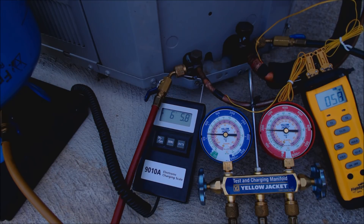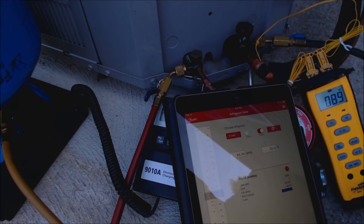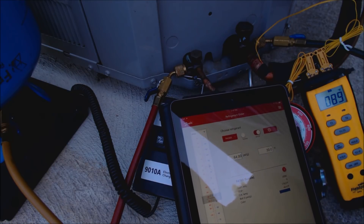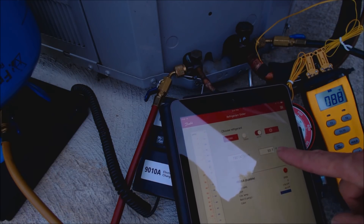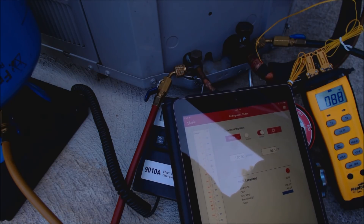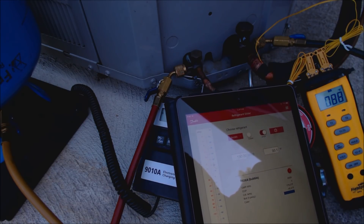That's good. I just wanted to make sure everything was healthy and that there's no liquid going into the compressor. If you have superheat, you know you don't have any liquid or saturated refrigerant going into the compressor. Now let's flip back over to our liquid line. We click on pressure and we have 190 PSIG now. That gives us 93 degrees as a saturated temperature in the middle of the condenser coil — so 93 minus 88 is 5 degrees of sub-cooling, so we need to continue adding refrigerant. The rating plate calls for 8 degrees of sub-cooling.